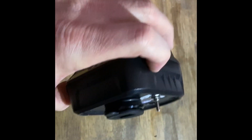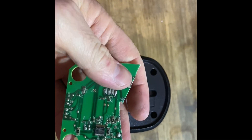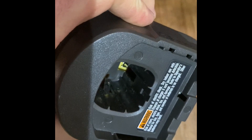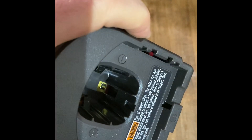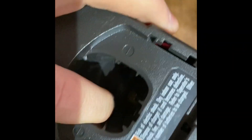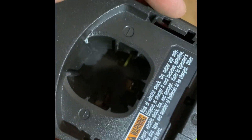So I got it all screwed back together. The only thing I would say is: you are jigsawing a circuit board in half, which means you want to make sure on the bit of circuit board that's still in there that you haven't crossed over something. The bottom line is there's only the two terminals inside here — the positive and the negative terminal. I clipped out that secondary one there that's negative; I really don't know what they have the third one for. So you want to make sure there's no short between it — just do a visual inspection of the board. I didn't try throwing a meter on it, but that probably would have been a good idea.